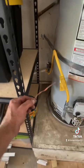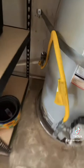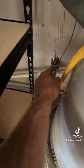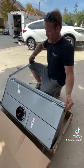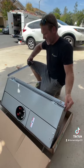Panel removed. I removed the existing number 12 bonding wire and replaced it with a number six from the gas to the hot water to the cold water. I've measured out the panel and now I'm going to trace it on the siding and cut it out with the multi-tool.